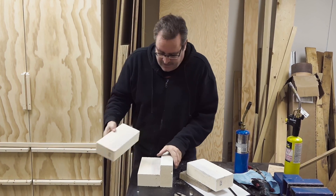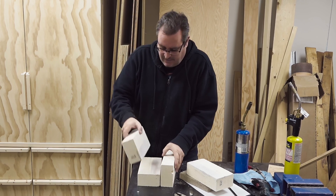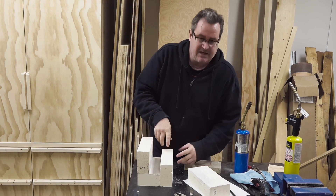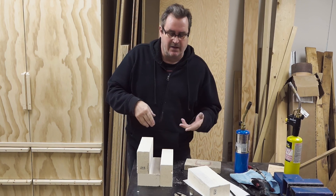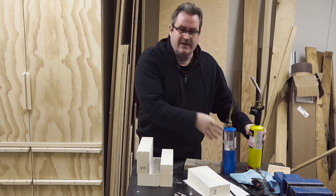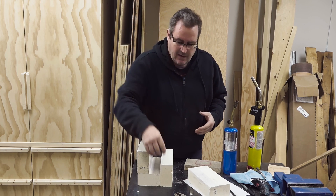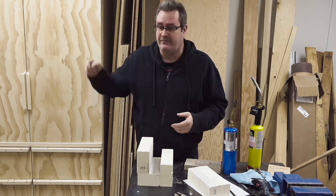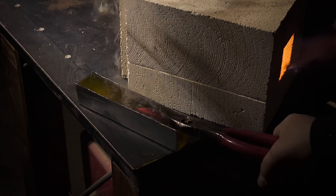It's very easy - I've just got the bricks loosely put together, four of them, and then another one to close in the end. Originally I had the holes in the fire brick both pointing forward because I'm using two torches for more heat when doing bigger stuff. A small blade like the one I did for the folding knife really doesn't need that much heat - you could even do it with one torch in an arrangement like this.